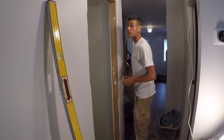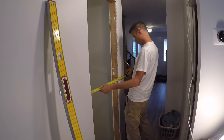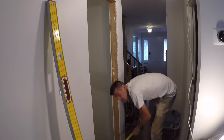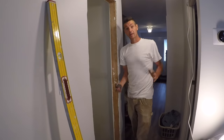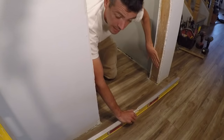The next thing I'm going to do is measure my opening to see what it is. I have 26, 26, 26 — small, so that's pretty consistent. Next I'm going to check the floor. If I wasn't clear, I was checking the hinge side — this is the side I'm going to start hanging the door on.